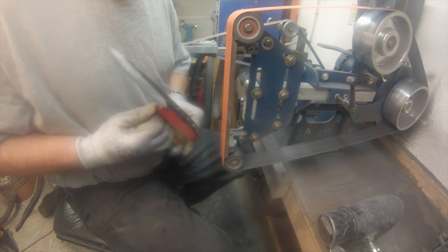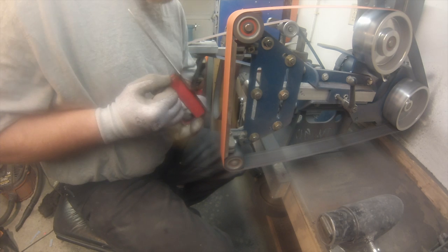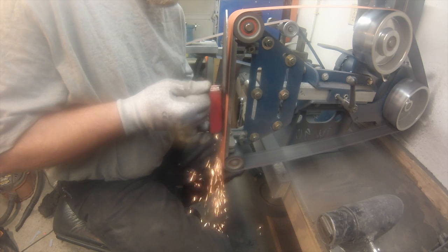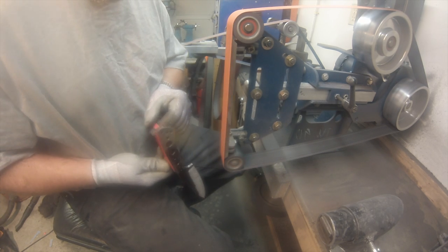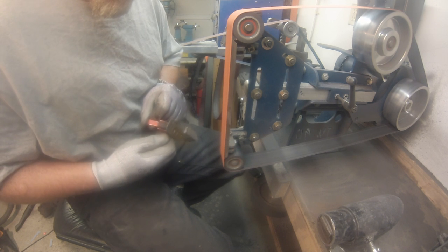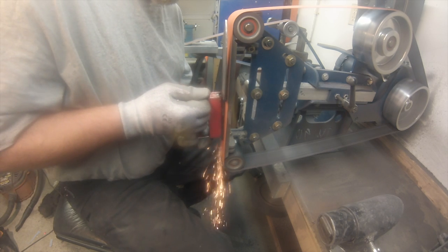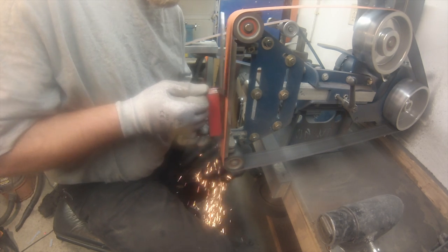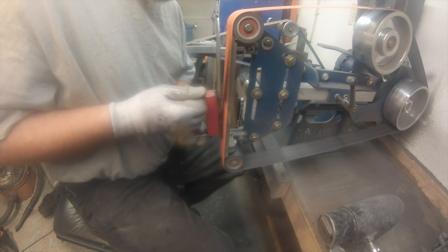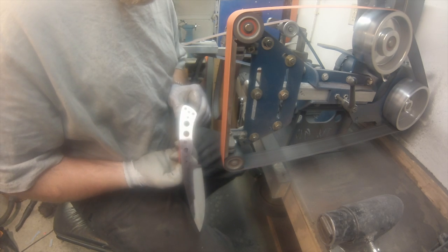I think I'll show you again. See how that blued up because I got it hot. It's thinner steel because you've already taken it off the other side, so it heats up a lot quicker on the second side. So I do this a little slower because I don't want that center line to turn all blue where I can't see it. So I think I've got it about where I want it, thickness-wise, and then I'll start climbing up this wall.